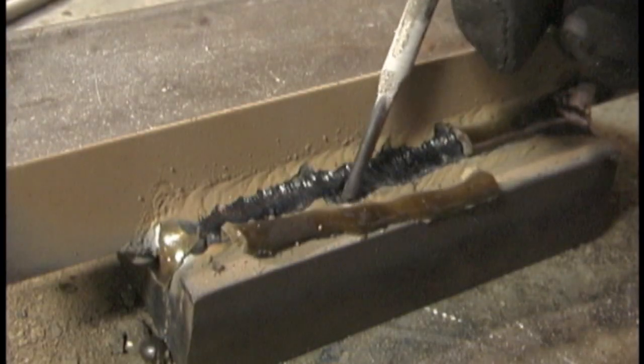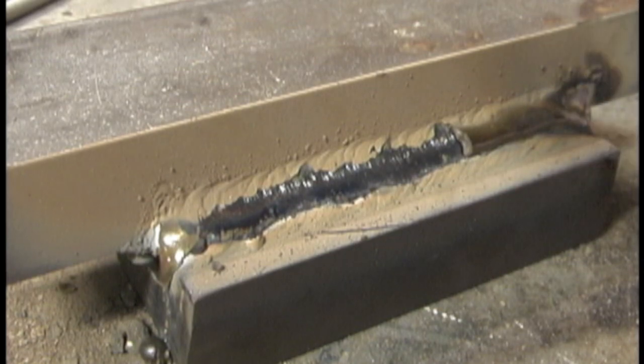Let's do that third bead. If you don't hold a pretty tight arc, occasionally it'll pop and you'll get some BBs. That is a drawback if you have the arc force set up high with a 7018. Most people prefer to set it around 30% or so for a 7018, which works good. But I just like to experiment with things like this.